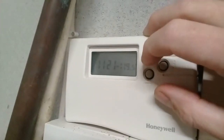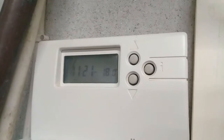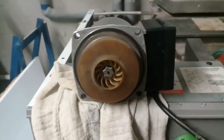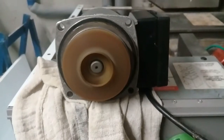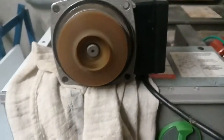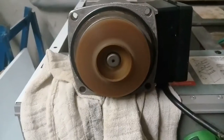So let's do the temperature up to 20. You can see the ignite light come on — received at the receiver. The microswitch — very slow. And finally, the pump. I've done a finger test on this just to see what the resistance was. So that looks fine to me.